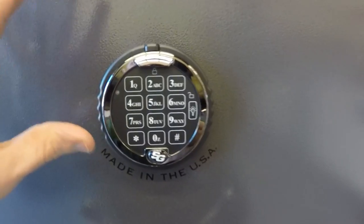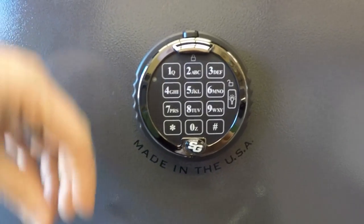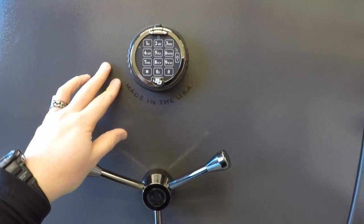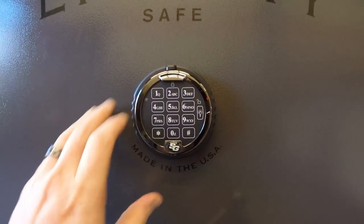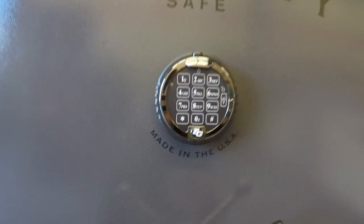The reason we're doing it this way is that years ago they had a large solenoid inside their locks. The solenoid did all the work — it would pull the bolt straight up — and it was that solenoid that would fail. As locksmiths, we were opening these religiously. So years ago, if you'd asked most any locksmith or safe guy which lock they prefer, honestly I would have told you mechanical, because I wasn't having great success with the electronic locks. Now that all changed. I think it was around 2008, early 2009 — we started rolling with products like the D-Drive, and great success, really good success. Six digit code, pound, and you're in. They're easy to change yourself; do it as often as you want to.